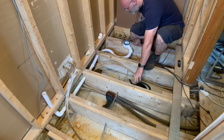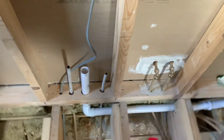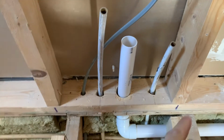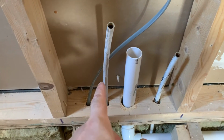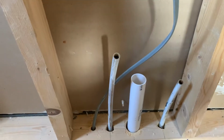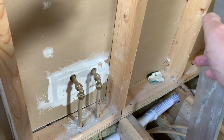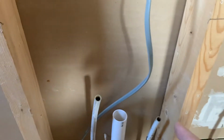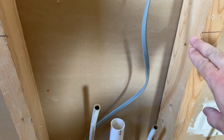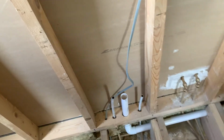Now, with the waste pipe out of the way, I really have to get moving with the actual water pipes. So I've moved these two fellas into the wall already. This is my hot water supply, that's the cold water supply. And the idea is to put in T-joints here, one there, and then connect the shower over here through the studs, and also put in wall connectors, whatever they're called, put on valves for easy connection to the tap hoses.